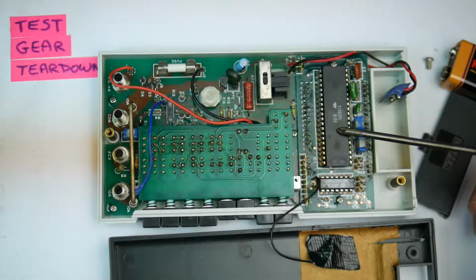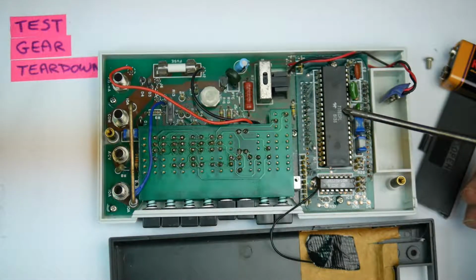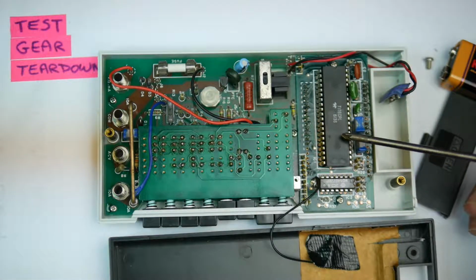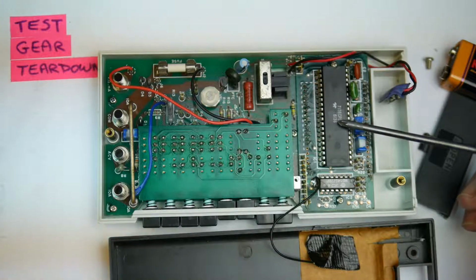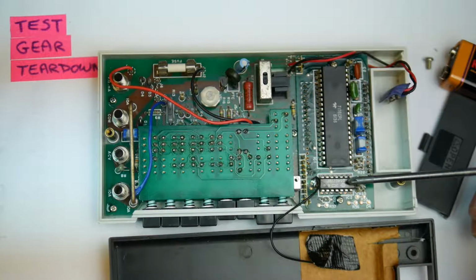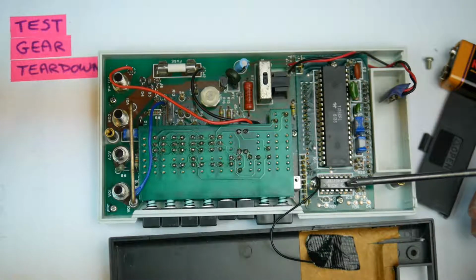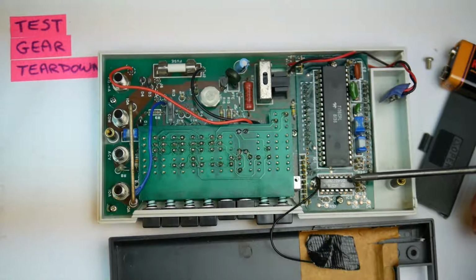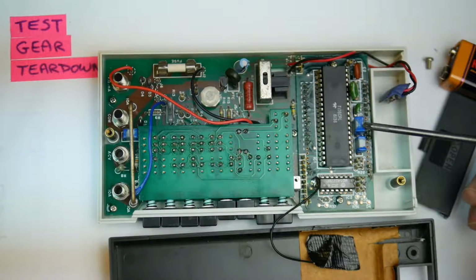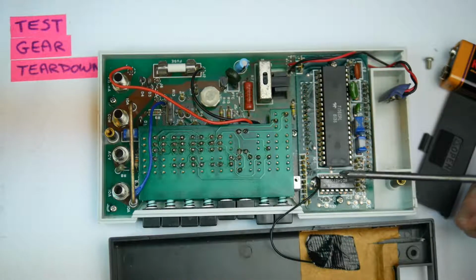So this big chip is the 7106. I think that's a fairly standard digital voltmeter chip. Date code is 8136, so this is 1981, week 36. A Hitachi HD14077, probably a CMOS inverter or gate of some sort, not sure what that's for. A couple of capacitors and a bunch of capacitors there. What else do we have?